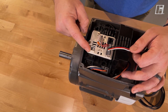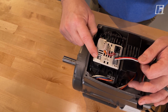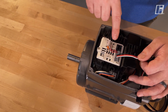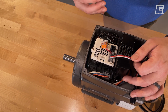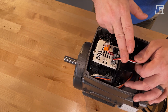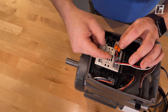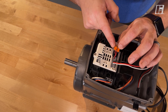Also right here we have a relay. From the factory, this relay is set to close whenever we're in a running condition, so I can actually send power through that relay to, say, a damper actuator. The damper will open whenever the motor is running and close whenever the motor is not running. From the factory, you'll find terminal one and two — I have a WAGO connector connecting those two points. Terminal two is an enable command; terminal one creates 24 volts. So whenever terminal two sees that 24 volts, it's enabled and can run at whatever speed you're telling it to. We give you a three-lever WAGO connector, leaving one open so you can run a wire from here to your controls. If your Verigreen control needs 24 volts just to be powered, you can use that 24 volts right from here.